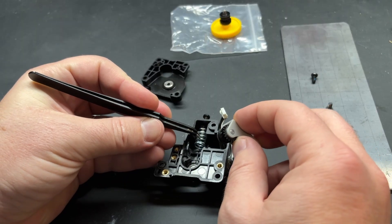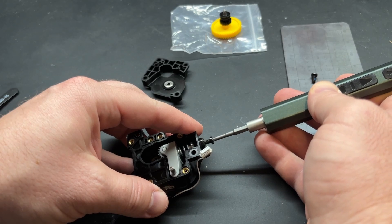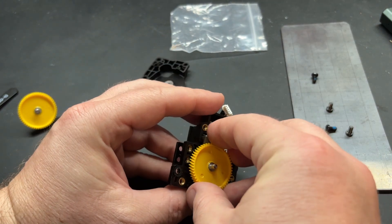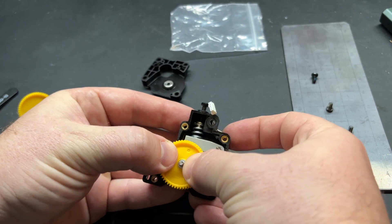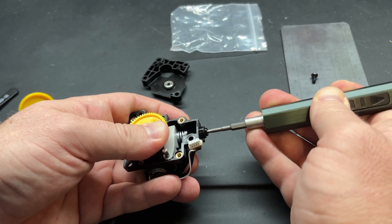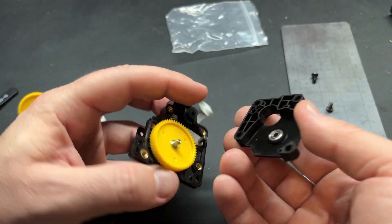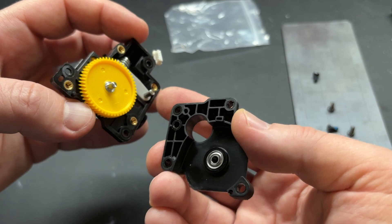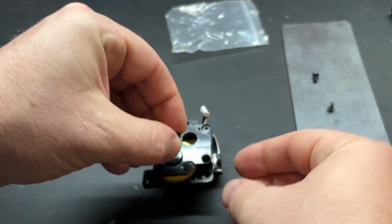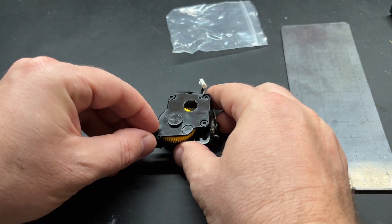To assemble everything, the process is just reversed. We begin with the active gear, placing it in the correct position, then tighten the screw on the top just a little bit so it holds in place. Before you drop in your driven gear, make sure the bearing is still in place, then carefully fit the gear in place — you may need to rotate it a little until you feel the teeth engage. Now completely tighten the top screw to fully engage the spring of the active gear. The final step is to put the cover back on, checking that the bearing on the other side aligns with the shaft of the gear, and that the hole aligns with the pin of the active gear. Simply align the two, press it back into position, and add all the screws back in and tighten them.